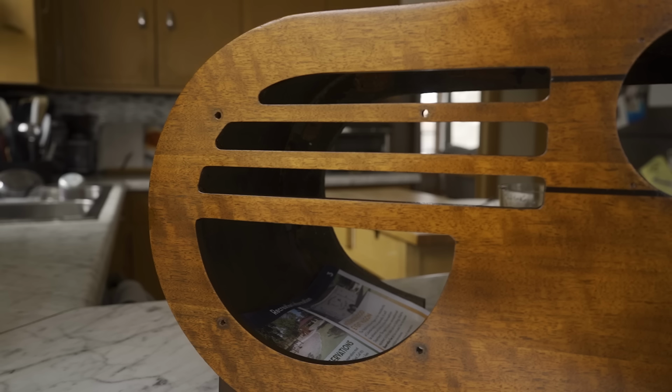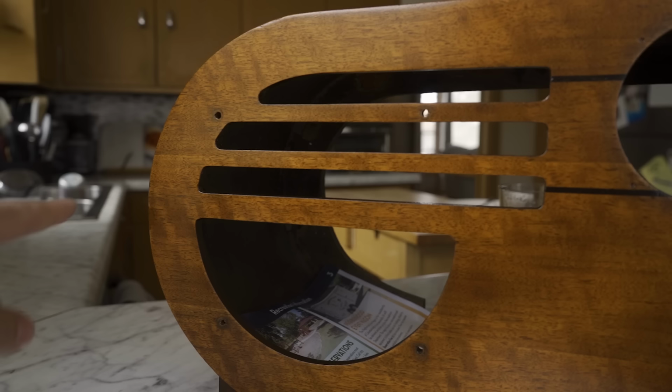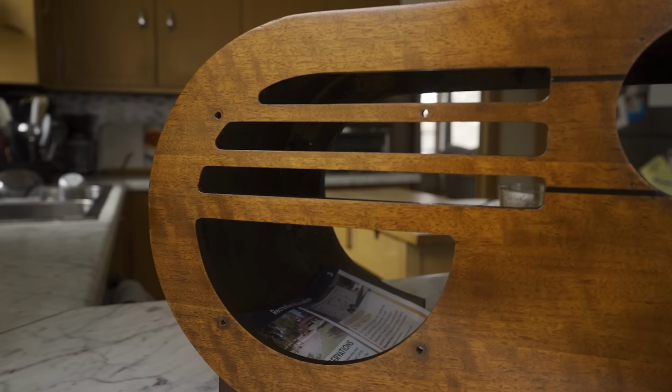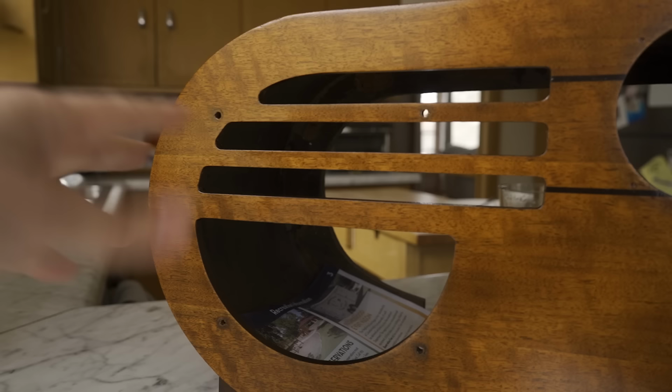And you might say, oh, well, maybe then you should put a real wood veneer patch in there and then you wouldn't have this problem. But then you just have other things you have to deal with. Like you'll have a seam going like that across the grain. So that's pretty challenging to hide. You have to try to hide that seam that would pop out. And then also, what if the wood that you choose for the veneer doesn't change color the same way this wood does?